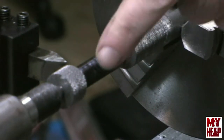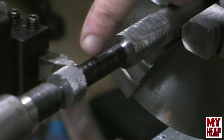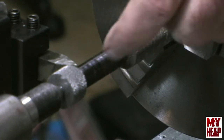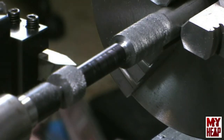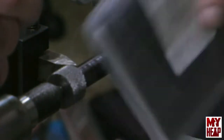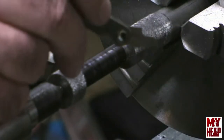I have darkened the metal here with the Sharpie so I can see the first cut. I have my tool on the center height, set square with my piece using my fishtail. Got the threading dial engaged, got the gear set up to 13 threads per inch. And I have got my thread gauge here to check it. Got some wire, so we're going to see how close. I think we're ready.